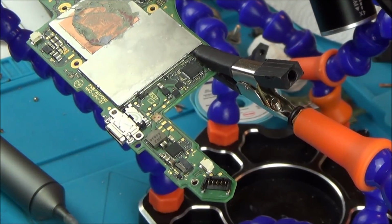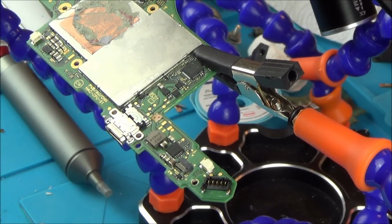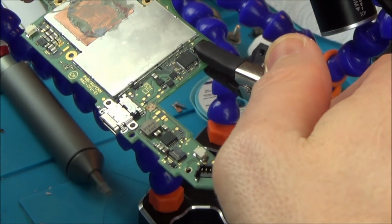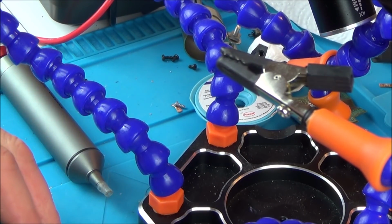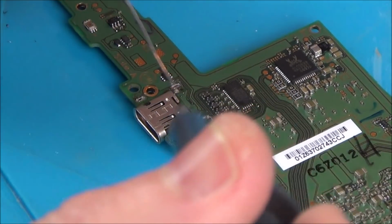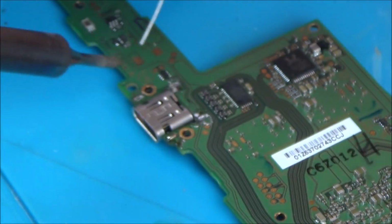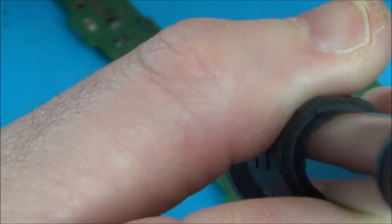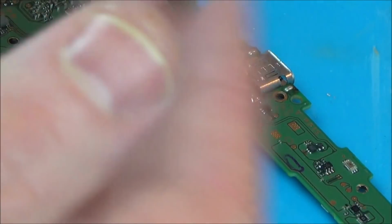Now we can turn the air off and we're just going to use a soldering iron for the rest. For me, I'm putting the soldering iron right up to 480C because it's a weak, cheap soldering iron and the boards just suck the heat up from it. Right, I can test the pins in a bit. Let's solder it up now. So we're using leaded solder, and I'm just filling up the holes. Right, I think I'm happy with that. I'm going to clean it up and then do the pin test by wobbling the pins. But remember, I can't get to the inner pins anyway.